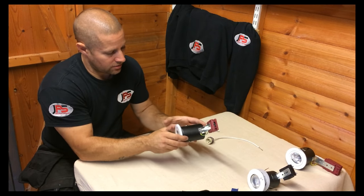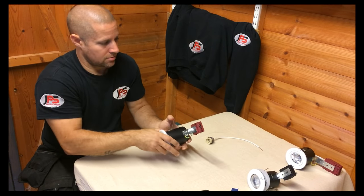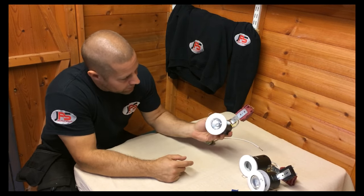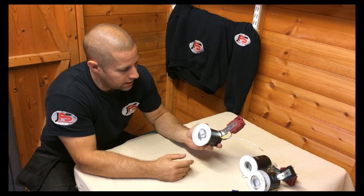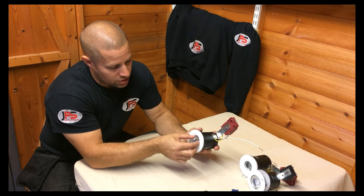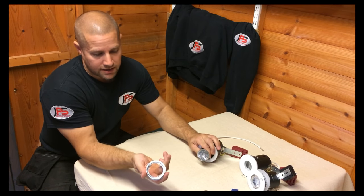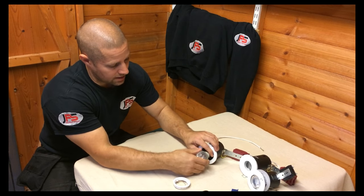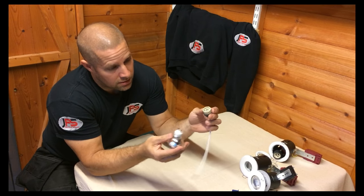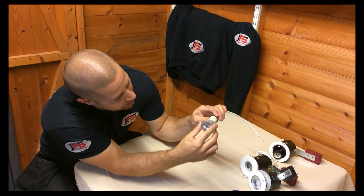This type we've just seen on the low voltage ones — just a twist. And finally, the last of the most commonly found fixings for these lamp holders is just a twist, and it's held in with the clasp. So twist it anti-clockwise to remove it. And then to install the lamp into the lamp holder, just line up those holes there and just twist it clockwise.